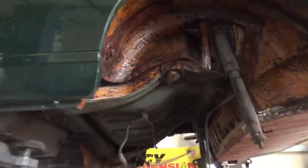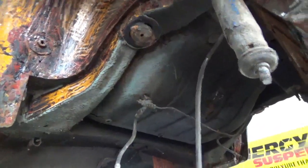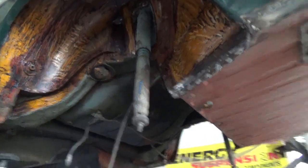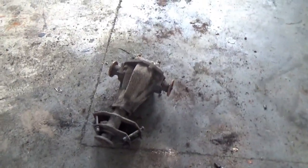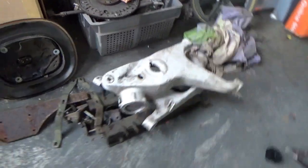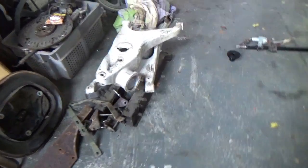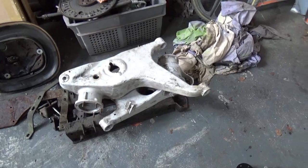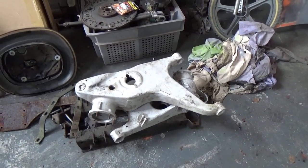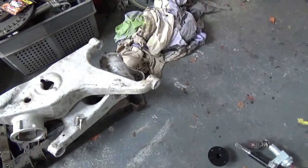The other thing about the stag: you'll notice the rear axle and beam is off. That will all need painting in there, of course. It's been quite thick undersealed, which has protected it — a little bit of a saving grace. The suspension is stripped. I have some sandblasting to take in today. As you can see, the lonely differential is sat on the floor there with its quill shaft in. That will need cleaning and painting, but I will say it does look oil tight. The rest of the stuff is over here to go off for blasting this morning — there are some other odds and sods, some bumper brackets and stuff. I thought if I could get the stag suspension stripped, I can get those blasted as well. I'm going to let him blast the back arms. These arms are still built up for the green stag, but I can build these ones up rather than strip those to build them back up. A lot's missing. These have been painted in the past, it's all flaking off and a mess anyway, so they need redoing. But they are good, tidy, straight arms — debushed and everything.